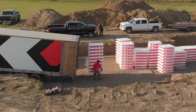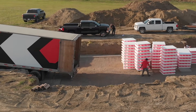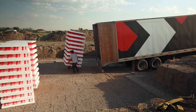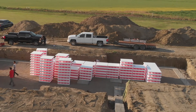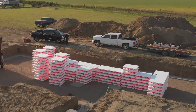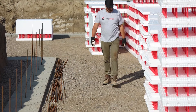In this video of the Superform ICF installation series, we start stacking ICF — this is where the fun begins. First, bring all your materials and tools into the center of the project. Keep all materials about 6 feet back to allow for diagonal bracing to be installed. Typically, you will work from the inside of your project for job site efficiency.